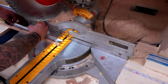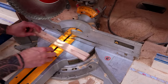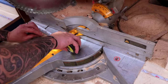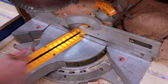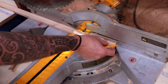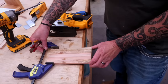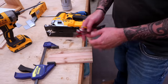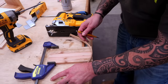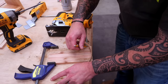So with our three-quarter-inch strips out, let's cut our seat backing. For the seat backing we'll need five boards that are eight inches long. While we're here, let's also cut our top back brace — still using three-quarter material, set the saw to 15 degrees, and this part will be six inches from tip to tip. Then take a one-inch strip and cut a six-and-a-half-inch board for the bottom brace. Now we're going to cut the arch back into our five backboard pieces — I'll measure down five-eighths of an inch on each outside edge, then use anything flexible to make the arch. I'll also include a template for this arch in the plans.